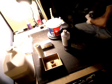So what I'm going to do is hit that tare button again to bring it down to 0. And we're going to start adding the catalyst. But first, I'm just going to need a stir rod real quick. Ow, it's really hot. Okay. I like using metal more than dowel rods just because that dowel rod is porous. So I need 2.7 ounces of this. So I can just pretty much go nuts here.